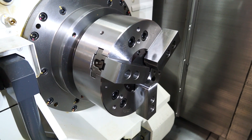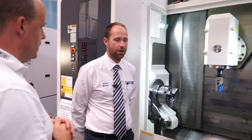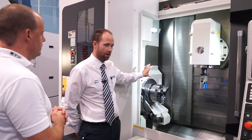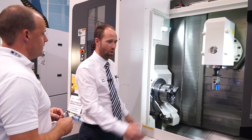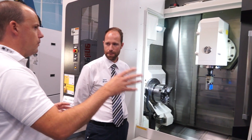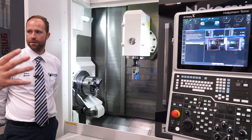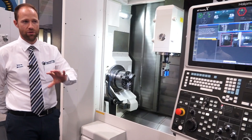What can the head tilt to? You've got plus or minus 115 degrees, so it's a full five-axis head — full five on the main spindle and full five on the sub-spindle. How new is this model? This was launched at our permanent trade show six months ago. The control has similar collision-guarding capability as on the other machine, which is definitely important when you're dealing with high-value components. You have exactly the same features across the entire Nakamura range.